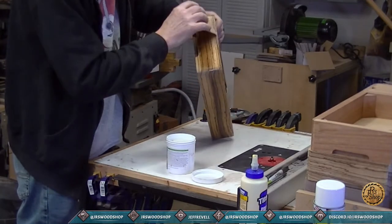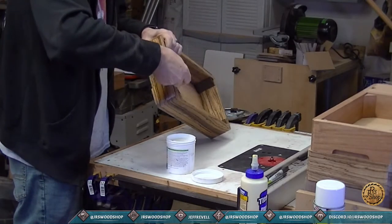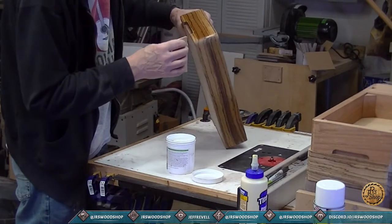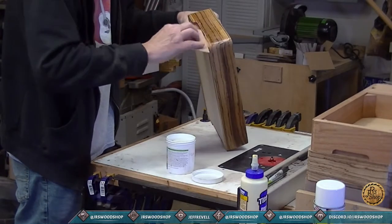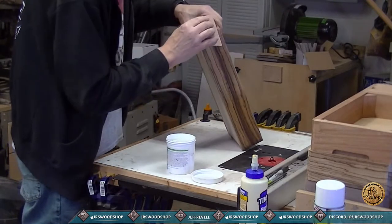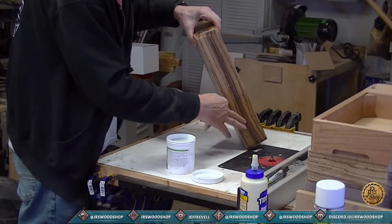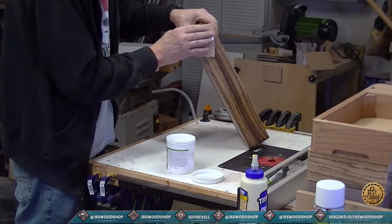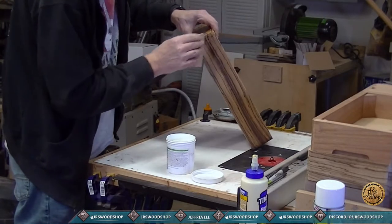This is the way that they suggest doing it, going across the grain. Like I said, I'm not going inside the handholds or anything else. This is not finish. All this is doing is filling those grain areas, because what we want left over after the fact is a nice smooth wood surface. And right now, I can feel all of this openness in this grain structure right there. It's not really pleasant to feel. So that's what we want to get rid of.